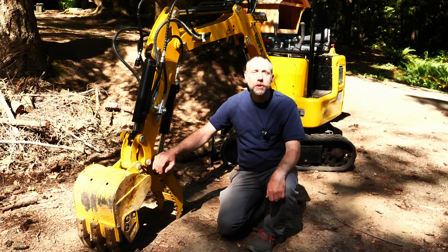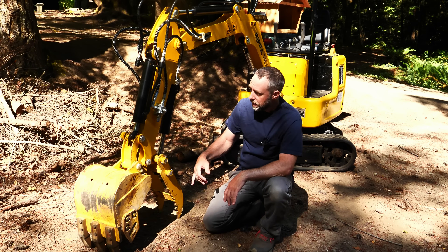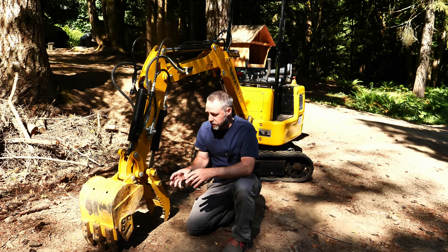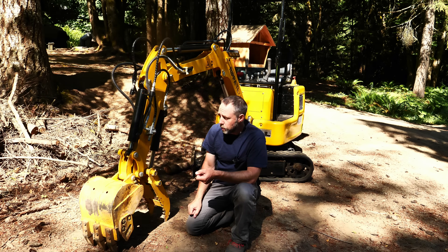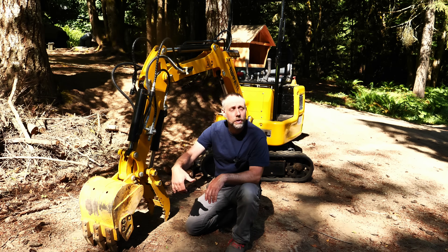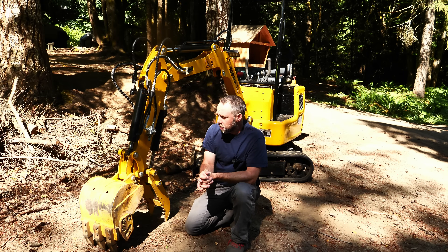There are crazy amounts of attachments you can buy for these machines. The bucket and hydraulic thumb are probably going to be your go-to most of the time, but you can get quick-change attachments to swap a bucket for a ripper or other tools. I want to mention though — you do lose some curl leverage with a quick-change because it offsets the stick a few more inches. So if you're ripping something big out of the ground, I don't really recommend the quick-change. But if you're going back and forth between an auger and a bucket doing lighter work, you'll probably want to run it.